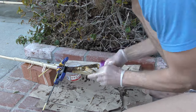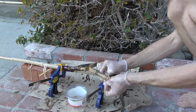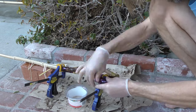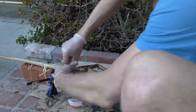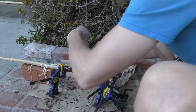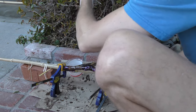Once I wrap the hemp around, I have a non-stick layer that I can wrap on there. It compresses everything, holds it together, and squeezes out the excess epoxy. Once the resin hardens it's relatively easy to pull this layer off and reuse it. I want to get a nice bond and smooth surface — it acts like an iron, giving a glossy, smooth finish to the epoxy. If I'm careful removing those purple wraps I can get many many uses out of them.